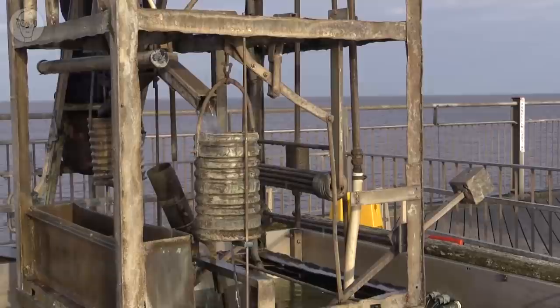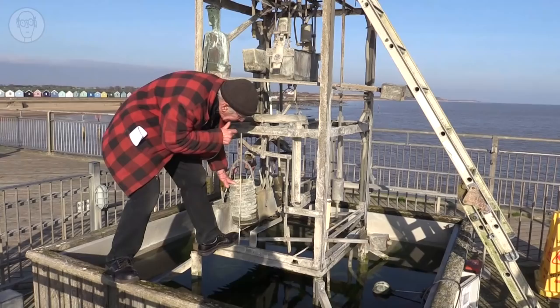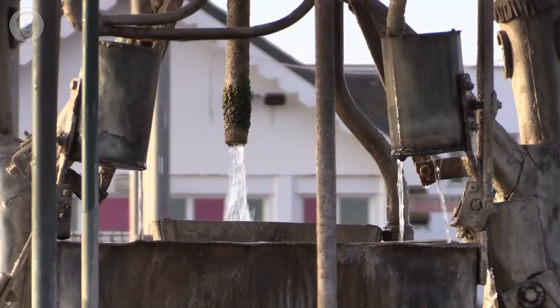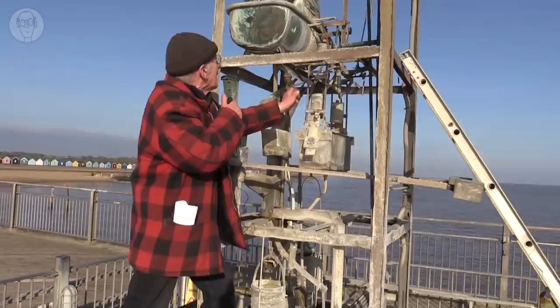And then once it is full, it tips this lever up here, and the longer lever down the bottom, which is attached to the flowers. And as it's quite a long lever, the motion of the flowers is pretty near vertical. Meanwhile, up the top here, there are two smaller cans that fill with water, and they're balanced so that when they get full, they just overbalance. The weight makes them tip over and dip out all the water. And they have these levers on the side, connected to another lever that pulls the figure out of the bath.